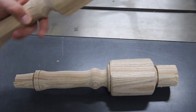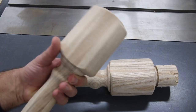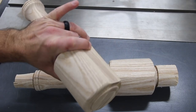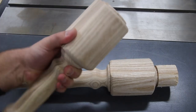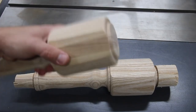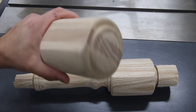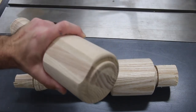Here I'm going to show you about the finger grip. I can lay my middle finger into that groove and grip the head of the mallet on the flat sides with my thumb and pointer finger, which gives me access to the round part of the mallet like a carver's mallet — great for working with a chisel. I could also grip the mallet handle with my whole hand using the finger grip, like a joiner's mallet, if I want to use the flat side. The flat side also helps keep it from rolling off the work surface.